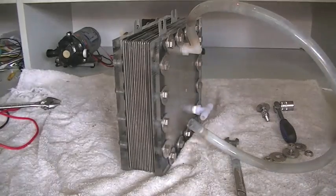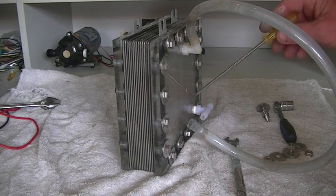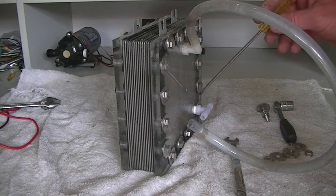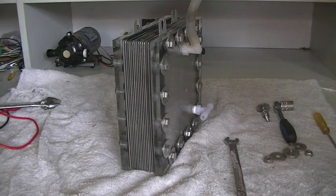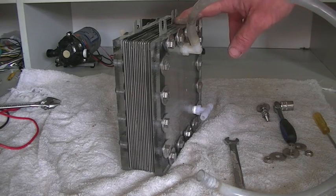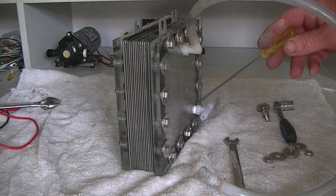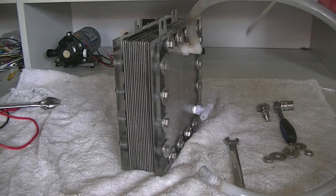As expected, it was that fitting — it was too close to the plate and that's what was blocking the flow through this half of the cell. I've put some thread tape on it now and haven't screwed it in quite as far, and now it's nice and free to blow through. A good thing to check is that you've got a nice free flow throughout your system and all throughout your cell, and you don't have small errors like that. That would have been reducing the flow of both liquid and gas in this half of the cell.